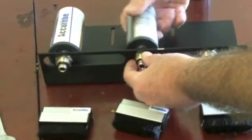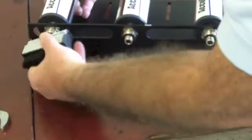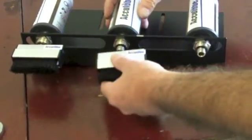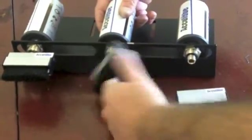Remove the protective tape from the back of the brushes and screw the brushes onto the fittings, tightening them firmly by hand. Position the brushes to fit the rope spread. When the brushes are in position and parallel to the edge of the bracket, tighten the lock nuts.